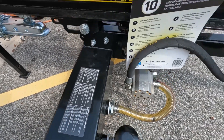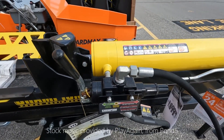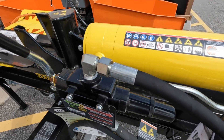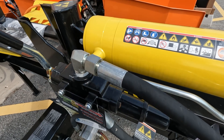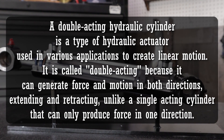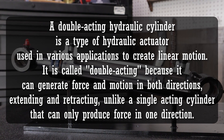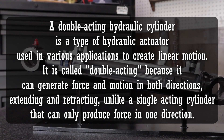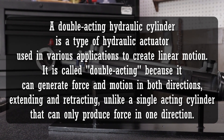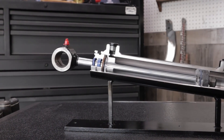Most hydraulic systems are comprised of a hydraulic tank, a hydraulic motor with a manual or electric valve, and in this case a cylinder being activated. We're using a log splitter which has all the basic components a hydraulic system would have. We're focusing on the double-acting cylinder — a type of hydraulic actuator that creates linear motion in both directions, extending and retracting, unlike a single-acting cylinder such as a floor jack that only produces force in one direction.